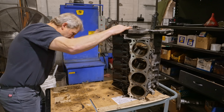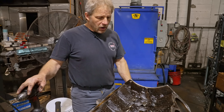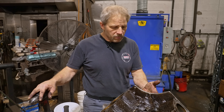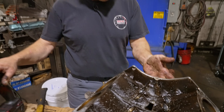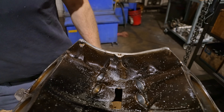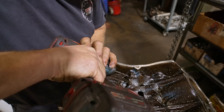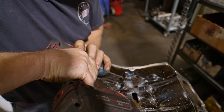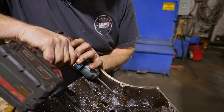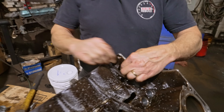There are two plugs up here that I don't know how to get to — there's just no way to get to them. Unlike the two in the front cover, I can't get to these from the back side because of the way they were drilled. So I'm going to drill a hole in them and use a slide hammer or some sort of prying method to get them out. You definitely want to clean these. Now with the pilot, let's see if we can get our Tapcon in here.